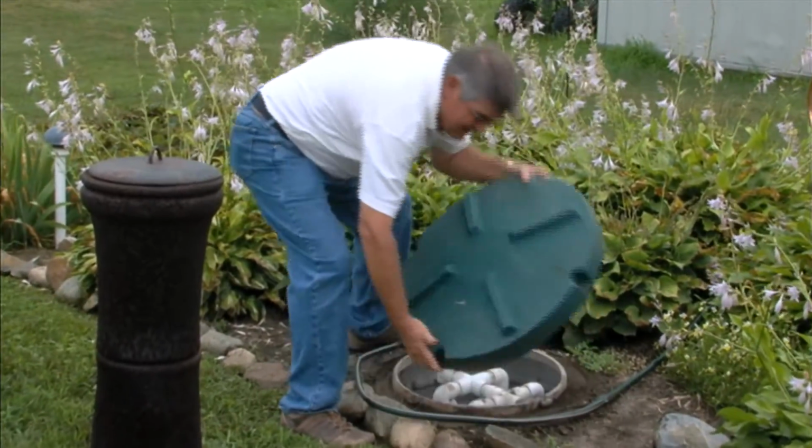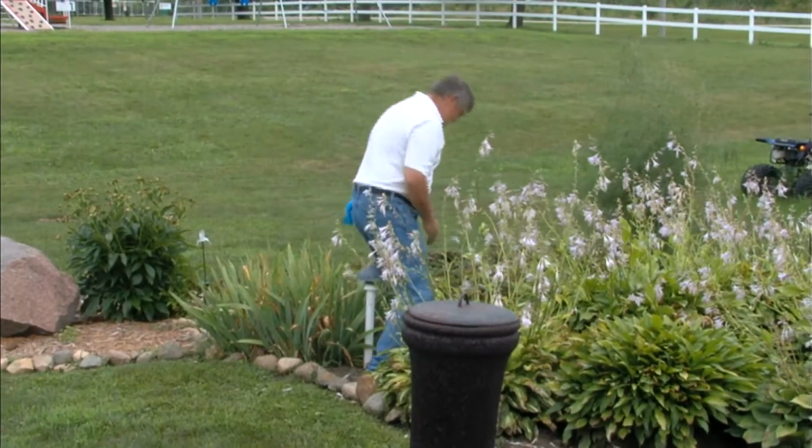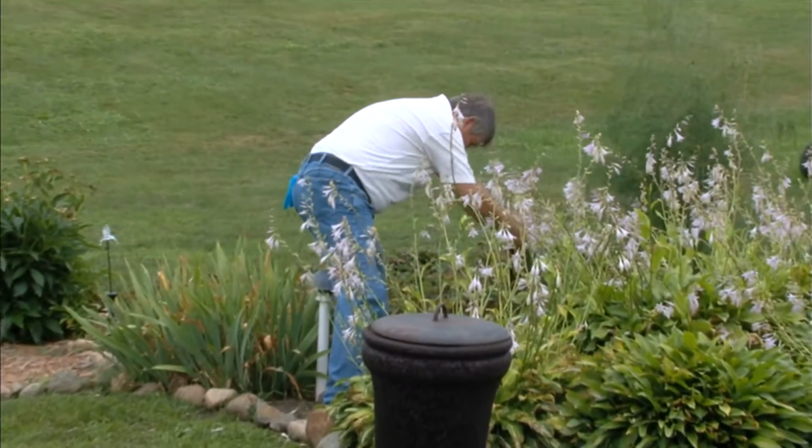Now what we want to do is go through the steps associated with routine maintenance of the BioCoir system. We recommend that this maintenance be done every 6 months, and if it's done properly, the system should give long, effective wastewater treatment. The first steps associated with routine maintenance of the BioCoir system would be quite simply to remove all the lids, make general observations of the area, note particularly if there are any objectionable odors or anything like that.